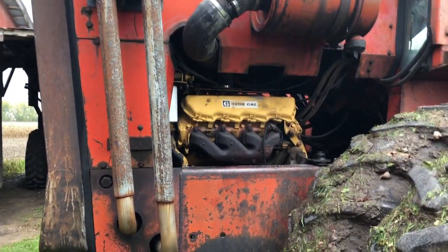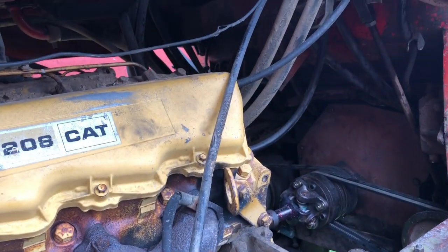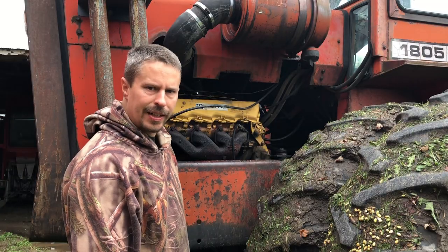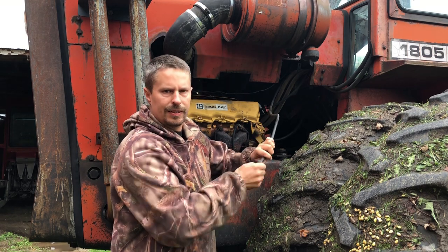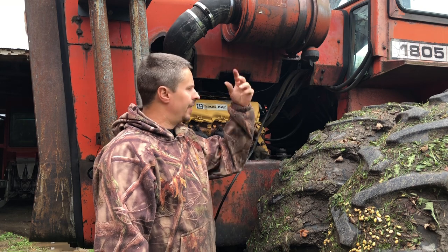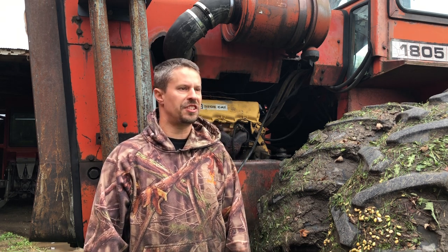The second part of this equation — the cable's got this burnt spot in it here, and it's got a big flat region in it. But that being said, the cable's not broke. However, it's got a catch. I put a drill on it. It'll spin the tach, but it's zit, zit, zit — you can hear the whole thing. It's just vibrating, shimmying and messing. Let's face it, friends, there's enough vibrating on this thing. I don't need one more thing going zit, zit, zit as I'm trying to sit in the field all day long.